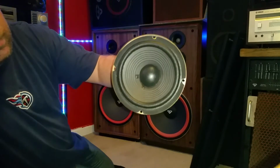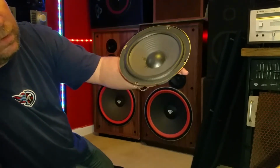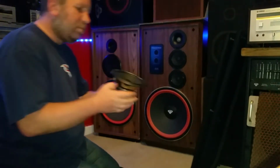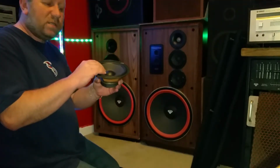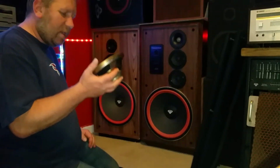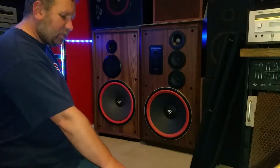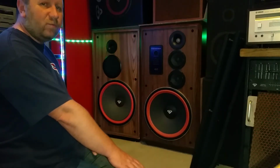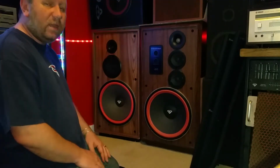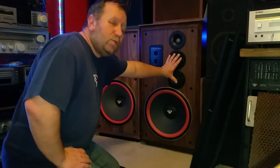Look at this one. It's almost like a 6.5-inch woofer or a subwoofer. It has a high curve, a wide curve, which is again made for this mid-range to move about. That takes this mid-range up to a different level than these. This one can operate in a lower frequency register than these can, and it can do it with force. It will move the sound in the air way better than these. That's why they use 2 smaller ones here.